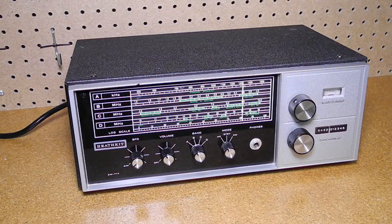The design uses nine transistors, of which two are field effect transistors and one a Darlington pair. It also has three ceramic IF filters. It's a single conversion SuperHet design using a 455 kHz IF frequency. It was a mid-range receiver in Heathkit's lineup. They didn't publish technical specs on the radio, but performance is typical of other radios of this vintage and price range.